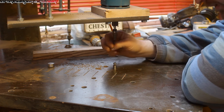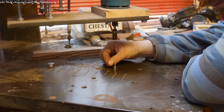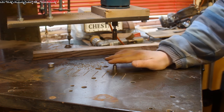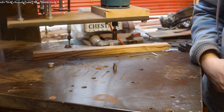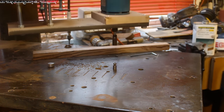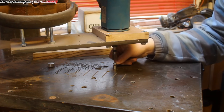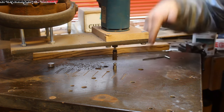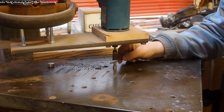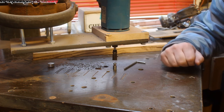But like most guitar builders, I started off with very little money, and yes, this works very, very well. Now, the final thing that you can do is use this to cut the internal carved cavity of a guitar — and that's fun. Basically, again, you set the depth — say you want the inside of your guitar to be five, six, or nine millimeters thick. Then you put your guitar in there, put that router bit inside your pre-routed control cavity, and slowly route away. And that is what I'm going to be doing today.